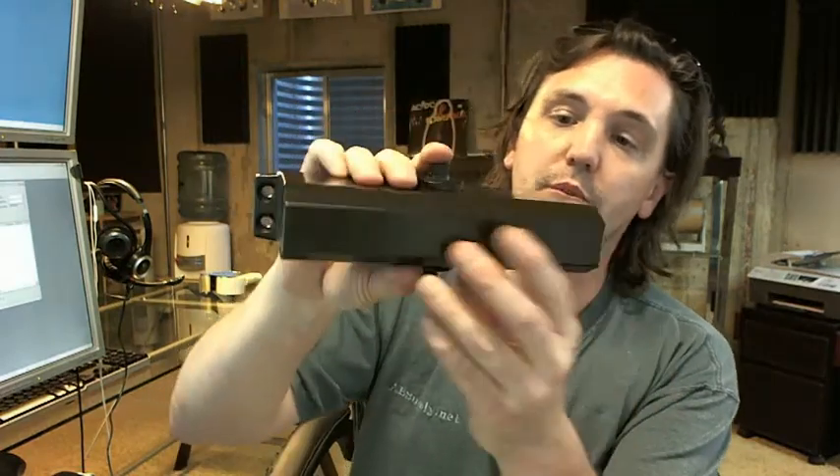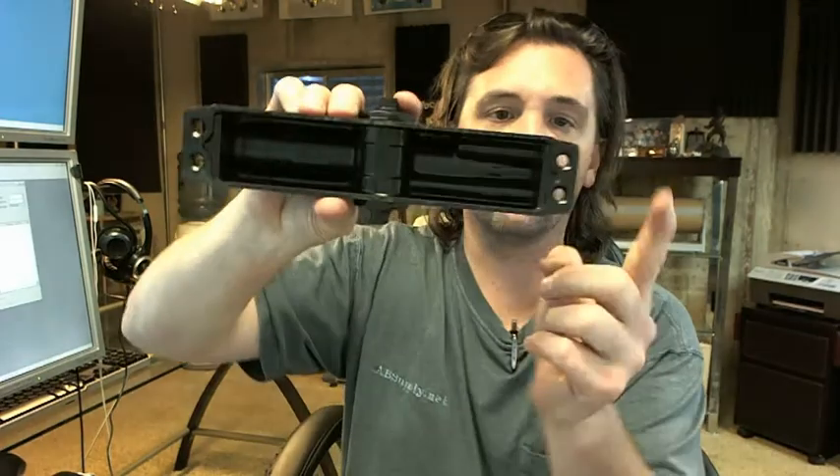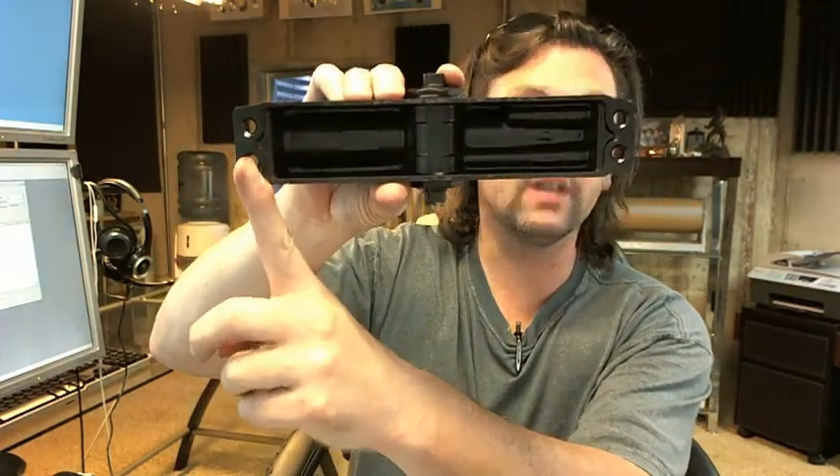Let me get a better view — yes, three-quarter inch. The commercial closers, the larger ones, are about nine and a sixteenth inches on the footprint from center to center. So you want to watch out for that difference.